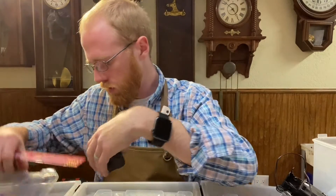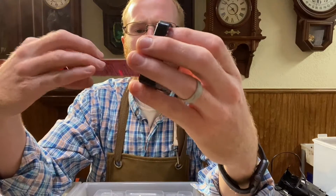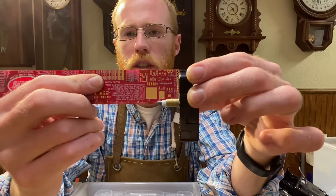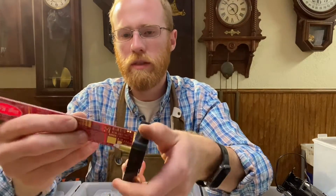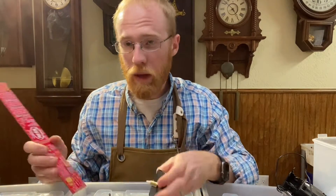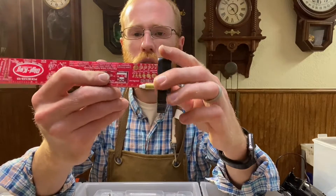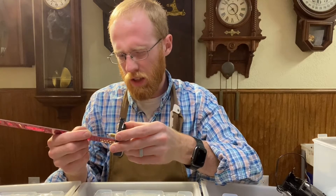On this one, we're talking about from the face here to the end of the threaded part. All you've got to do is take a ruler and put it up against the face — not up against the ledge, but on the face itself — and then just measure to the very end, which on this one is 19 millimeters. Same thing here: just measure to the very end — 22 millimeters on this one. It might be listed in metric, or it might be listed in US — or both. This one is about 7/8ths of an inch, and this one is about just over 3/4.